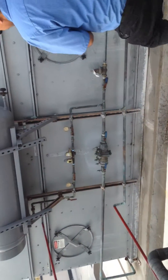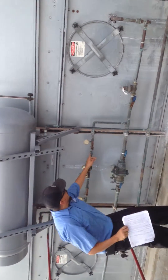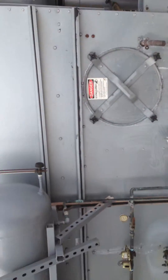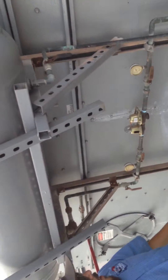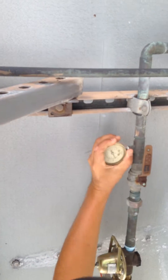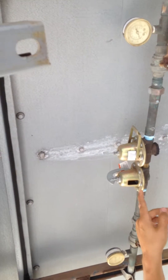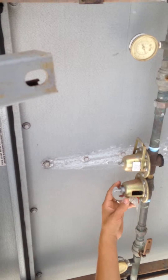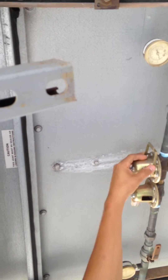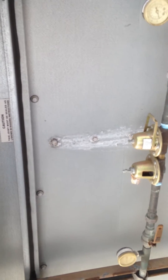The reducing station is this here. City water comes in — let me get a closer view of what's going on. So the way this works: water coming in, this is our relief valve. Our relief valve is set at 30 PSI. This is set to come in at 12 PSI, so only 12 PSI water is coming into this bad boy.